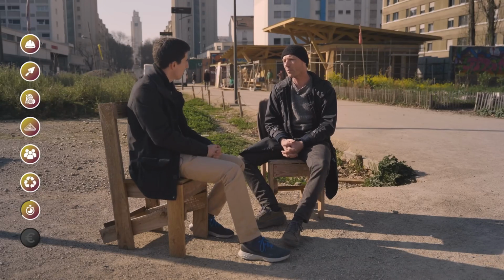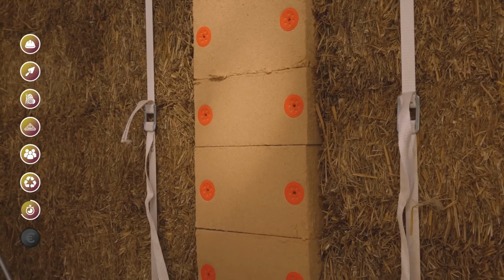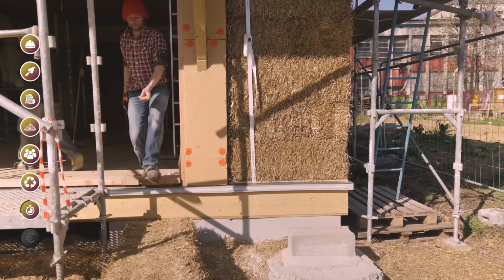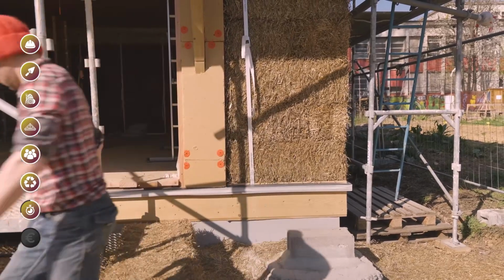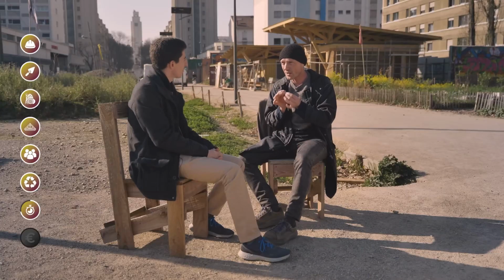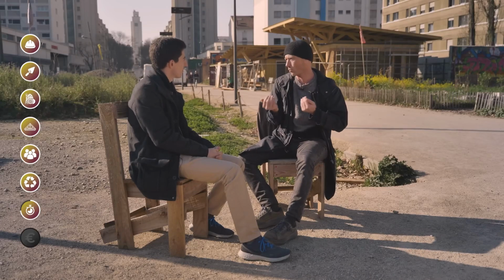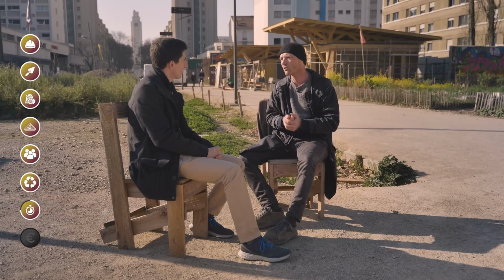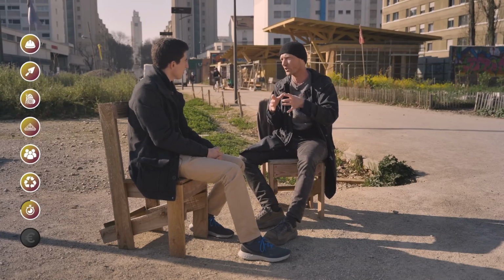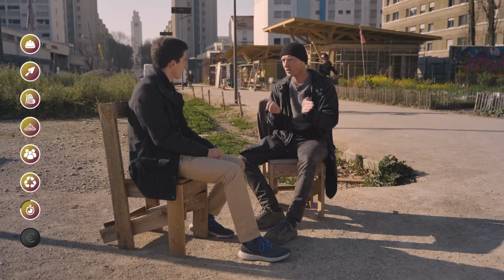For example, it seems simple because we take straw bales and we stagger them, like we would use brick, for instance. But to have a wall that is straight, well compressed, on which we can add a floor above, it's a whole lot. It's an expertise that is learned, and it's a bit of a shame, I think, to improvise it. So it would be, I think, not risky on very small sites, but on sites that would be a bit large, I invite everyone to come and get informed.